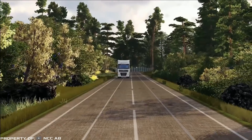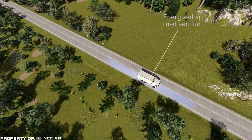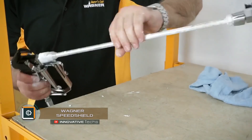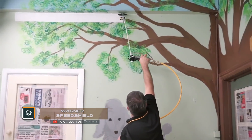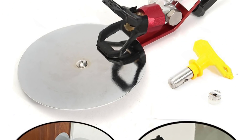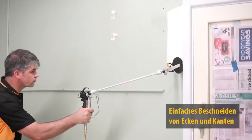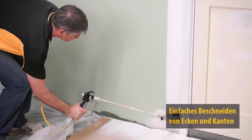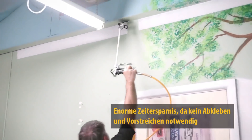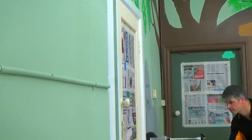The Wagner Speed Shield is a device for painting corners and jambs. The gadget is used for various types of painting works and is an increased-pressure airless paint spraying machine. The size of the attachment for the paint spray gun or extension cord is seven or eight inches depending on preference and the equipment included in the package. The main advantages are neat, smooth, and fast painting of any corners, no need to cover the ceiling, and no additional equipment required.